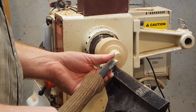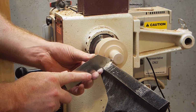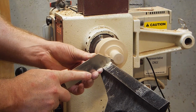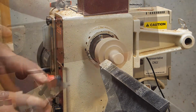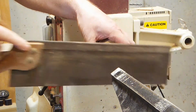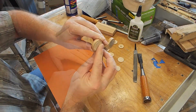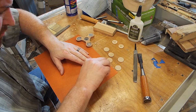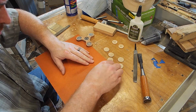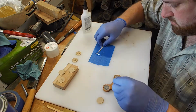Next was the weight covers. These are just convex with a 7/8 inch shoulder with the parting tool and cut off with a handsaw. For each of the covers, I sanded the shoulders so it would sit flush. Then I marred the lead for better adhesion with the glue, and glued the finger holds and the weight covers onto the fidget spinner.